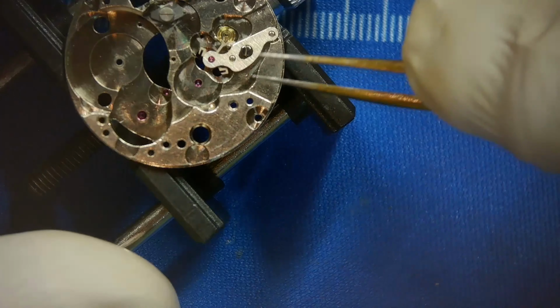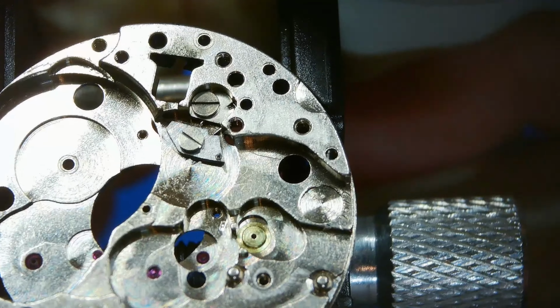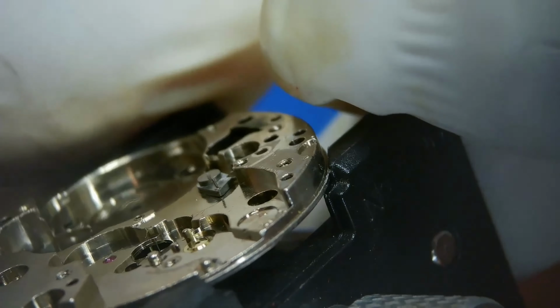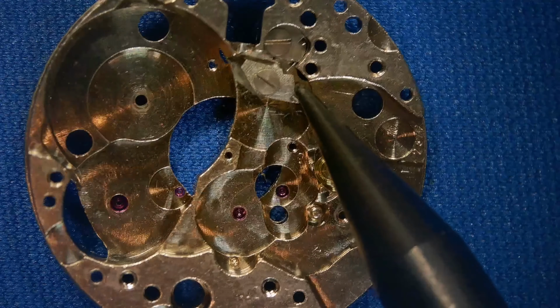Shoot that across the room. I had a lot of issue in this watch dropping and flinging parts, and the last couple of watches. I did some research on dressing my tweezers, and they got this thing that's called duck billing, at least that's what I think it was called, where the tweezers don't meet great. I believe that might have been a lot of my issue, because I dressed them later on in this video, and it's immediately noticeable how much better it is after I dress them.